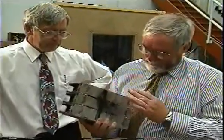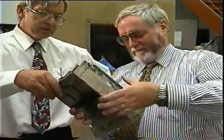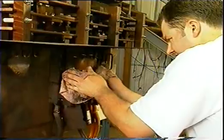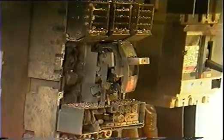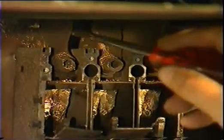Respected electrical engineer Peter Crosley comments. After the first test, certainly the integrity had gone. As you say, the contact resistance clearly went up each time. My biggest concern out of this test is that there's no clear visible sign that the breaker was damaged. The integrity of the breaker certainly has deteriorated. The second breaker was clearly unserviceable. We couldn't use it again. It virtually vaporised internally. Parts of the breaker went right across the test station. And that probably would have killed the operator.